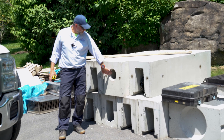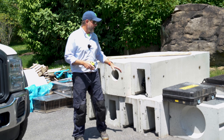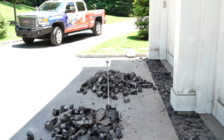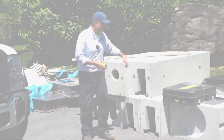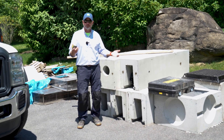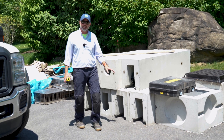This is an end unit into a drain. We're going to use a six-inch drain — massive drain. All that water is going to flow right out of here fast and get it away from the house. That's the strategy. To put these in, it's a pretty major undertaking. We saw cut the asphalt. We pick all of that out neatly so we have a nice clean seam, and then we bring in the machine or even hand dig with shovels and picks and jackhammers to loosen up the soil below the asphalt and get our depth. In this case, this is 20 inches, and we go probably 22 inches so that we have a little bit of space to play and work and get pitched with our units, and we might lay this in a mortar bed to get it to stay where we want it to.